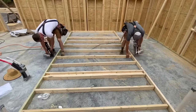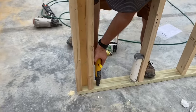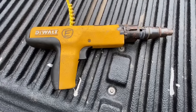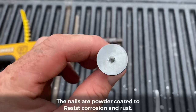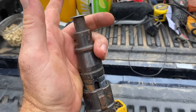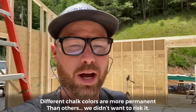Once we had all of the exterior walls framed on this house, it was off to the races building the interior walls. These interior walls don't need anchor bolts like the exterior walls because there's no uplift. We use a powder actuated nail gun to fasten them to the floor — it uses a .27 caliber small bullet with no projectile to fire the nail into the concrete. These nails have big washers so they catch on the bottom plate very securely. On account of the stained concrete floor being the finished floor, we did not chalk our lines through the door openings, because that chalk line might not come off and you'd have a blue or red line across your finished floor.